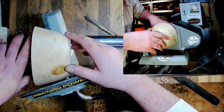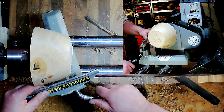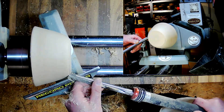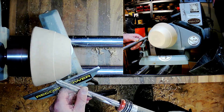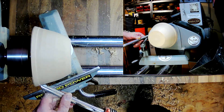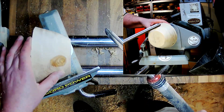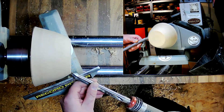It's not the nicest piece of wood. When you get areas that have a lot of tear-out, you can try going the other way and sometimes that will get rid of the tear-out. So we'll just gently go the other way and see what happens. As you can see, by going the other way it's got rid of nearly all that tear-out. We'll just do another pass — just got a little bit left in there.